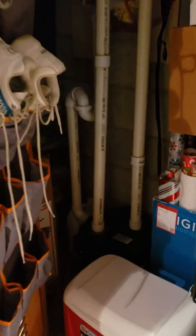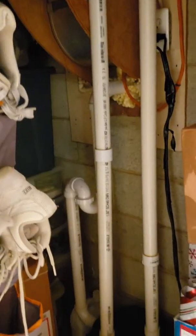It's about 10 feet here, and the laundry tray pump is over here — all this stuff will be gone. This is the laundry tray pump. Check valve — it's just double cycling. This is the vent. There's no fitting on top of it, there's no Studor vent, so we need to put a Studor vent there.